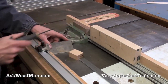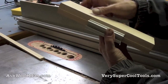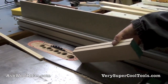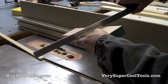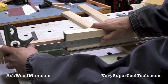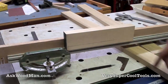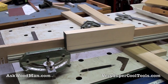I've got the track cut here. It's asymmetric because I'm cutting a shoulder to clear the back of the cast iron miter gauge. This was trial and error — I drew it out and just snuck up on the lines, kept testing, and I'm pretty happy with how close it is. I'll cut just a sixteenth of an inch above the scribed line to give clearance for it to pass freely, then cut it back one inch and rabbet it on the table saw.